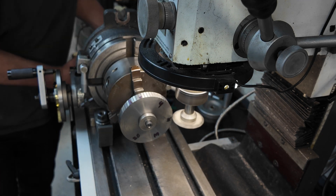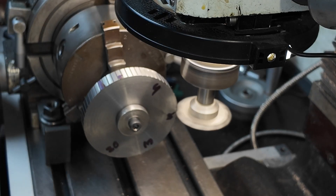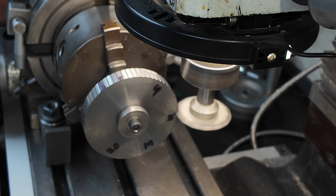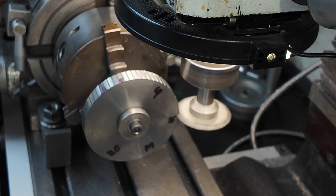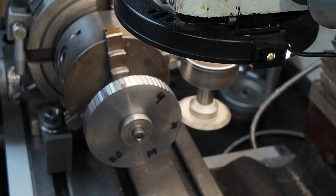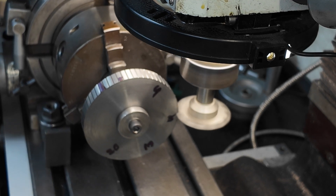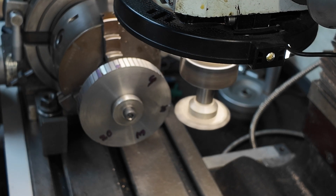You can see I've already been around once just to make sure we've got the right number of divisions - I never trust those books. So I set it up and did a test run, which took ages, then counted them; that's why there's writing on the end of the wheel. It worked out. The other thing that's easy to get wrong is the clearance between the cutter and the chuck, especially where the jaws are, but I got that right as well. So it's just a matter of going full depth.